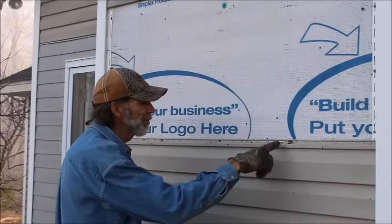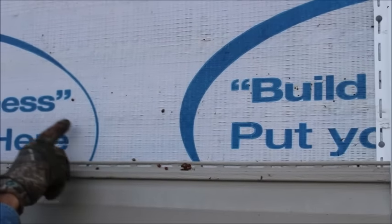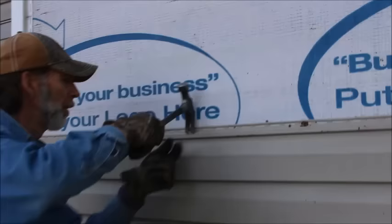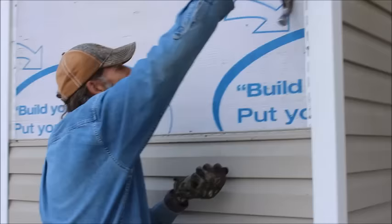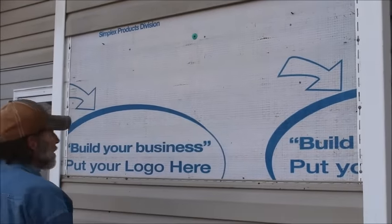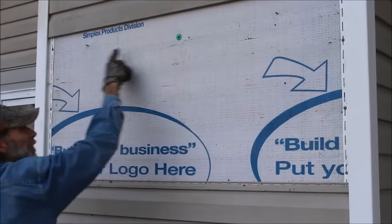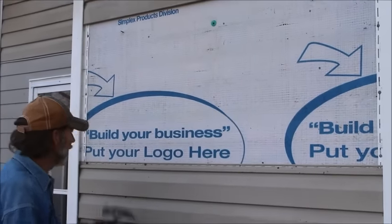This is one of the things about vinyl siding bugs — they get all underneath here everywhere, they're just piles of them. They look like ladybugs but I don't think they're actually ladybugs, I think they're another type of bug. Taking this vinyl siding off, as y'all can see, what I did when we took the fireplace out from the inside: there's a door framed up behind this that I framed from the inside. I ran screws out right here and here — that lets me know where the inside corners of that door frame are. And there's going to be two screws at the bottom so I know exactly where to cut from the outside.